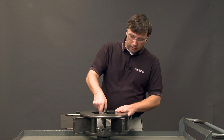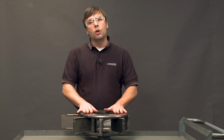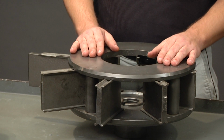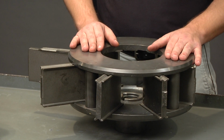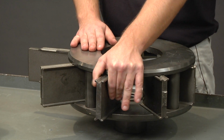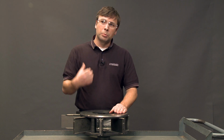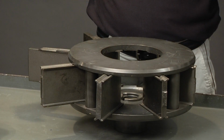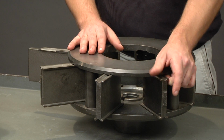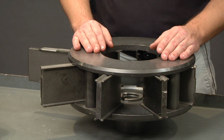All tune-up kits and blade sets, when they leave our foundry, are weighed and balanced within 3 grams of each other, ensuring that you don't have any excessive vibrations inside the blast wheel. It's held in place through centrifugal lockup and requires no additional pins, fasteners, spring clips, or additional hardware to lock in each blade, unlike some older Wheelabrator designs or competitive designs.